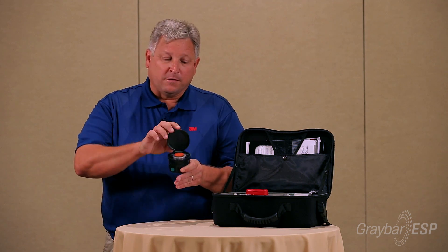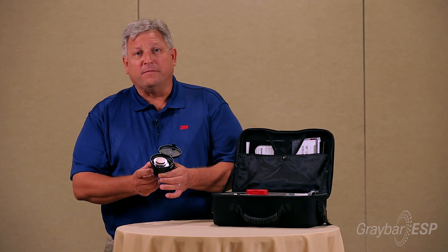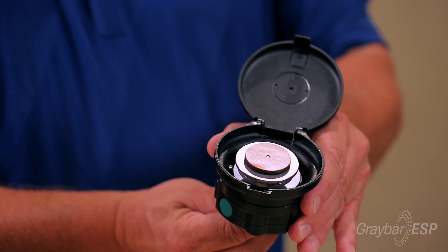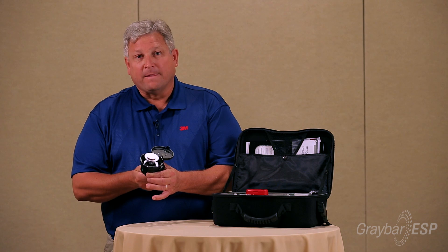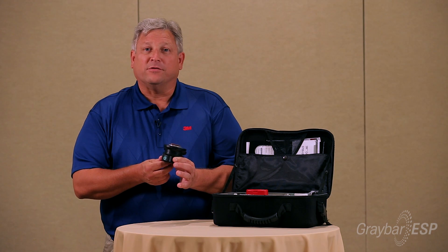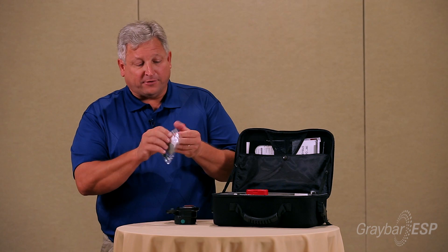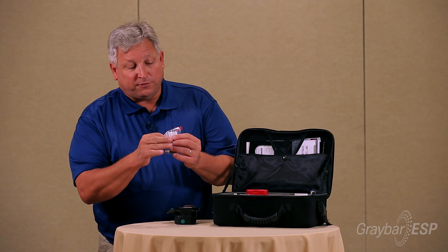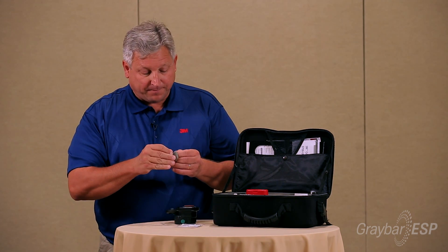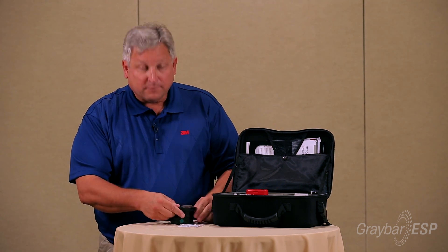To open it you press the side lever here and lift up. Watch: I'll push this button and as I turn the hand grip, the table underneath is going to spin in one direction while it travels in a different direction. I spin this until it locks and the button goes back to reset. The connector itself is a one-piece connector and it includes a 2 micron polishing film, which I will place on the table like so.